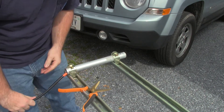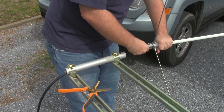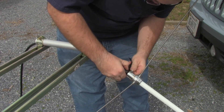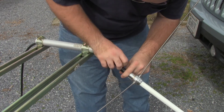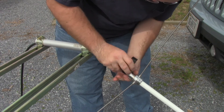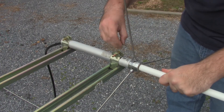I did as much pre-construction as I could down on the ground so I wouldn't have to do this stuff in the air. That included terminating cables and doing all the weatherproofing on all the RF connections. I like to use this mastic butyl tape — it sticks to itself, so you can just wrap it around the connection nice and tight by stretching it and it will stay right in place. I also like to wrap one or two layers of regular vinyl electrical tape around this. It's not necessary but it will ensure everything stays in place over the years, especially with the heat of the sun.